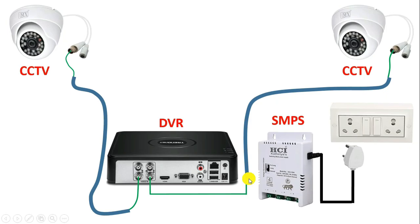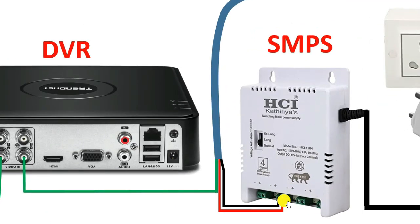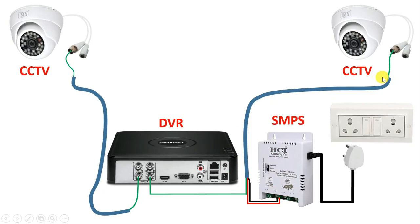Now in this cable, there are remaining three wires. Among these three, you have to use any two wires to provide DC power supply to the camera. So what we will do — I am taking the red wire of this cable and connecting it with the positive terminal of this SMPS. After this, take the black wire of this cable and connect it with the negative terminal. You can see here how I did the connections. Now take the output of these two wires and in this camera, with the connector where we have to connect DC power supply, connect these two wires. Here also, we have to use this type of connector for doing connections. Right now I am doing connections directly to show you.